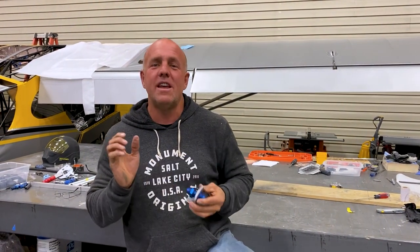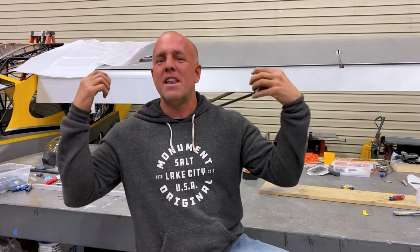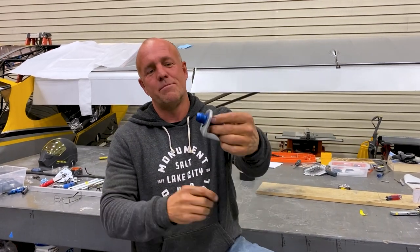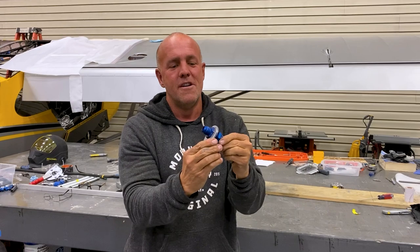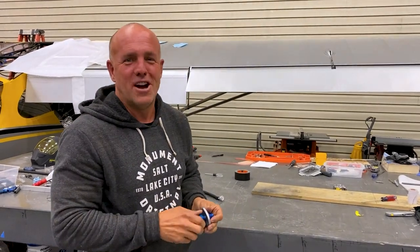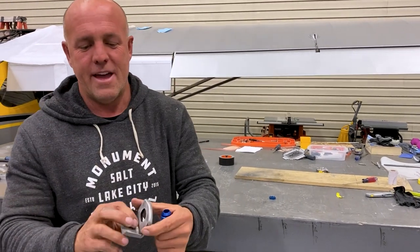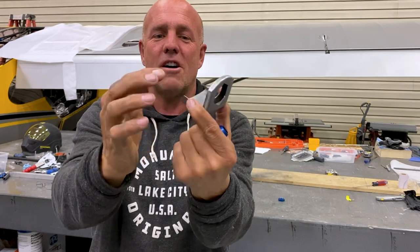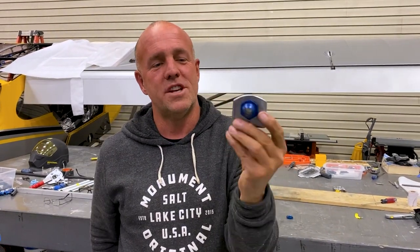Simple little task — we need to make the secondary fuel tank removable. It's a larger fuel tank to give this more of a competition-style Carbon Cub for going to and from an event. We wanted a nice big tank that can come in and out with a couple of quick pins, and we also wanted the fuel line to disconnect between them really quickly and close off. The place the fuel line needs to connect is in a tight spot. I made a simple little bracket that holds one end of the AN fitting so you only have to get a wrench on one side — it can't spin, it's locked into this little tray. Josh actually built this one. It's hollow inside, super thin chrome moly, but it locks in so you can one-hand wrench it — quick and easy.